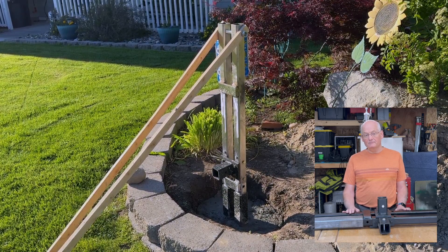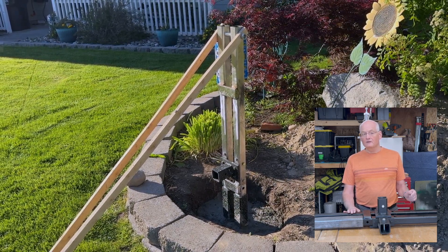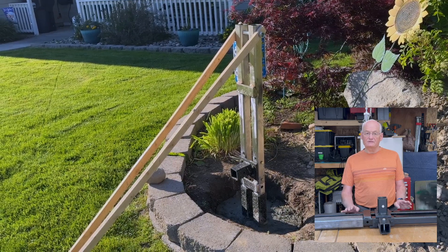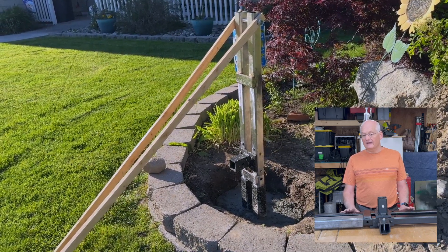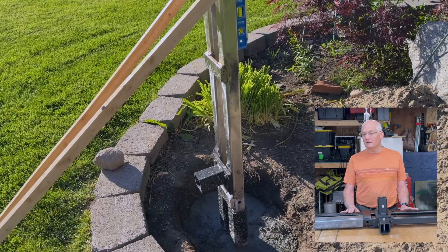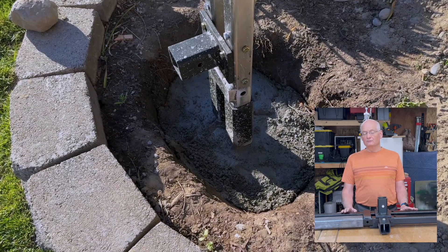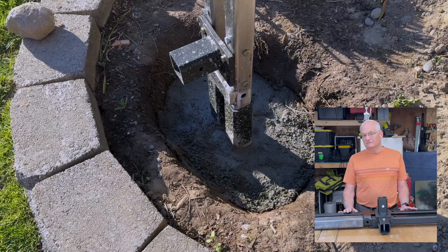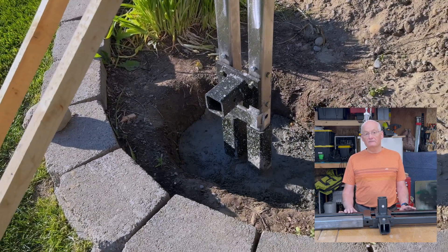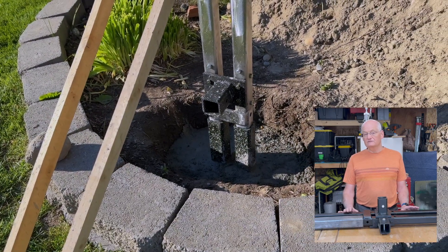Then I trued it up, made sure it was straight up and down. Once I got it plumb, you'll see the two pieces of wood on the screen where I've attached it to the hinge point — that three-quarter-inch bolt on top — and staked it in place. I double-checked everything was true, then poured the concrete and let it cure. I didn't come all the way to the top level of the soil — I left an inch or two of room for soil to go over the top, so we could plant annuals there in the spring so nobody could tell that a megatree goes there in the off-season.